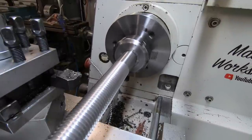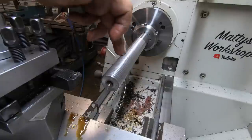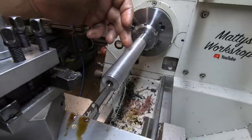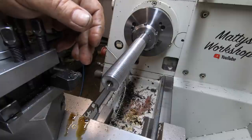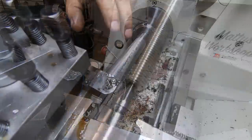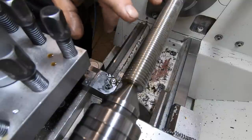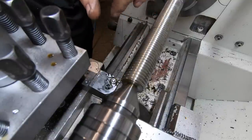Well, well, well - you've all obviously picked up what I've done wrong. This is still 25 mil, not 24. What I'm going to do is turn the thread off, turn the mill off it, and then try and pick up on this thread again. I don't know how I forgot that, but I did. I'm just going to do this off camera and see if I can save it - machine that one millimeter off it. I think I have picked up on this good enough now. I'm going to be making the nuts to suit this, so if this thread's not quite 100%, so be it.